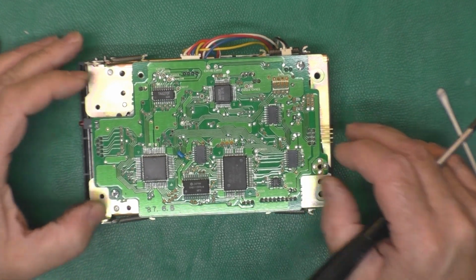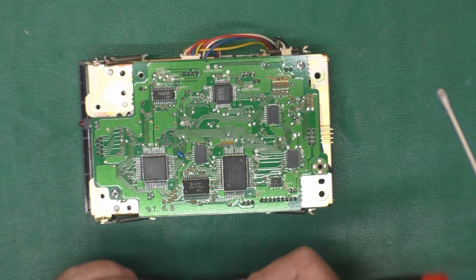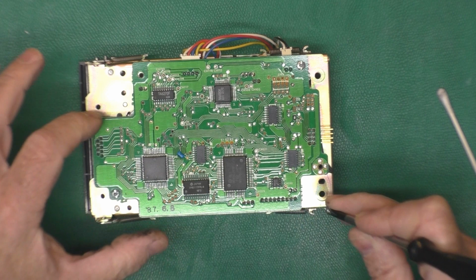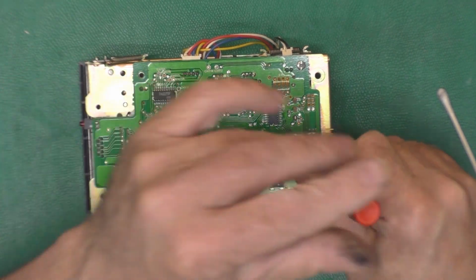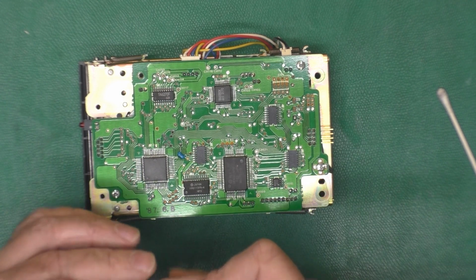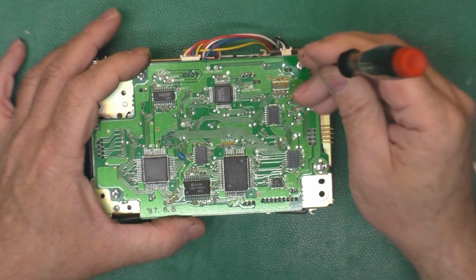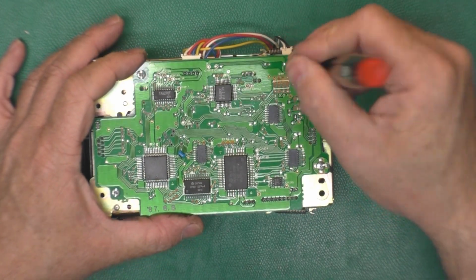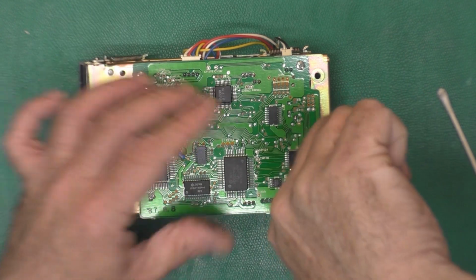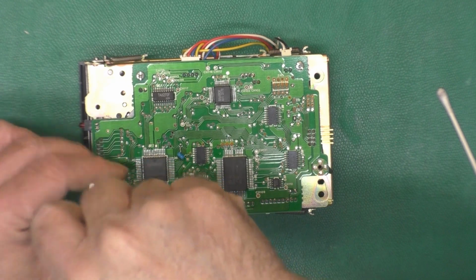And I'm assembling the board here. One tip here is that you need to tighten the screw before putting the little RF shield on. But there's 3 more screw holes around here. So if you start those screws to keep everything aligned, just like that, then you can tighten this guy, and pull these 3 back out, and then they'll be aligned when you go to put the RF shield on.